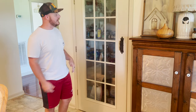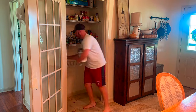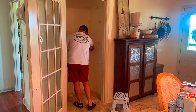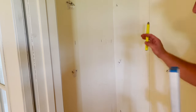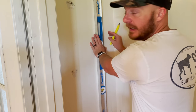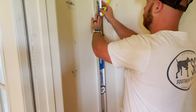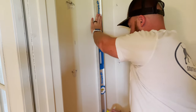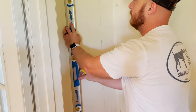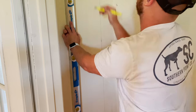The pantry door is almost complete — just a little touch-up paint on the back — but now I'm going to empty out the entire pantry, take out the old wire shelves, get measurements, and go to the store for lumber. I found the studs and went ahead and marked them using a level and a pencil, marking all the way up the wall. That way I won't have to second-guess where to put my screws — all the screws will be in a stud and these shelves will be very sturdy.